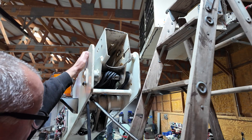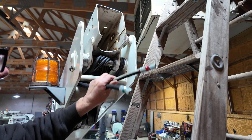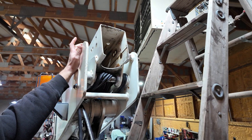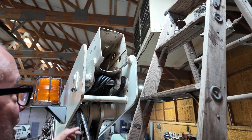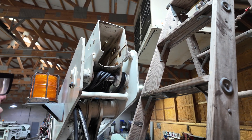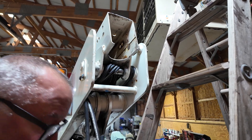Here we are at the opposite end. We have a couple of hydraulic fittings here that attach to a valve. On this particular model, which is a VersaLift, we have four screws — two here and two here — that hold everything in. Altec uses a pin in here; you'd remove the pin and slide it all out. But let's go take a look at the extension part of it and have a look at that.